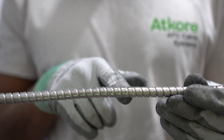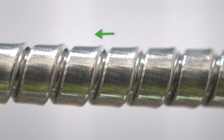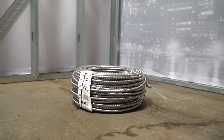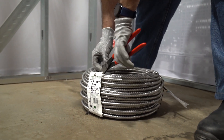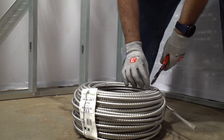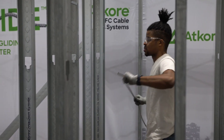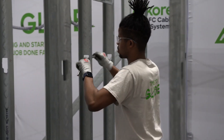So when you feed armored cable, you want to make sure that the interlock point comes second, not first. Every installer has experienced pulling MC cable in the wrong direction. This is very noticeable with traditional MC. But be aware that with MCGlide, you can mistakenly feed the cable in the wrong direction and not realize the true benefits.